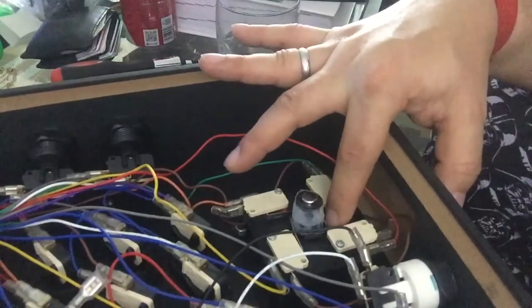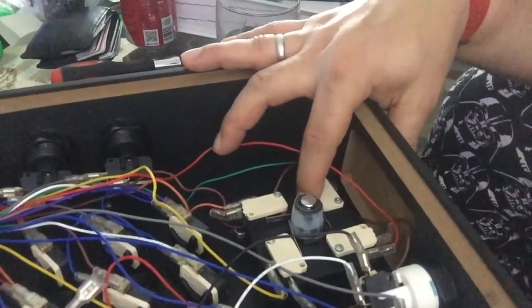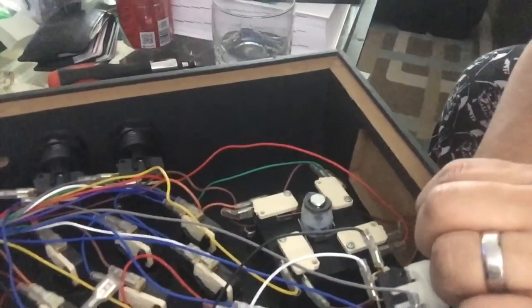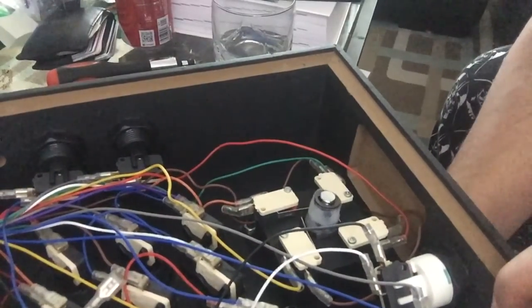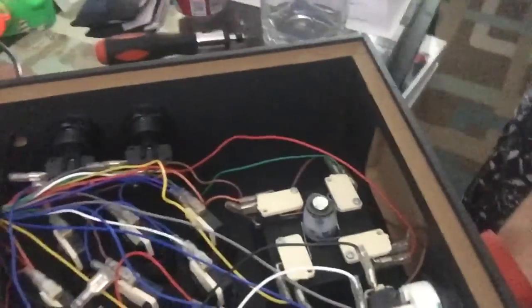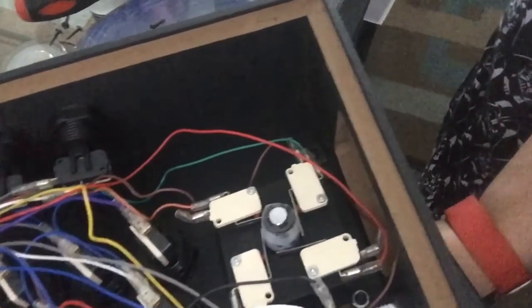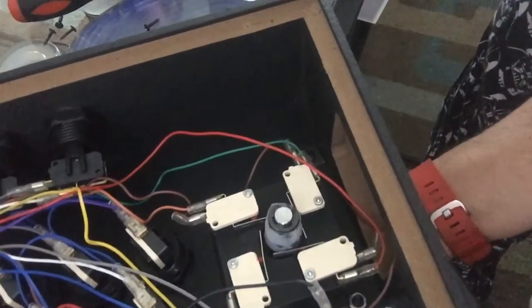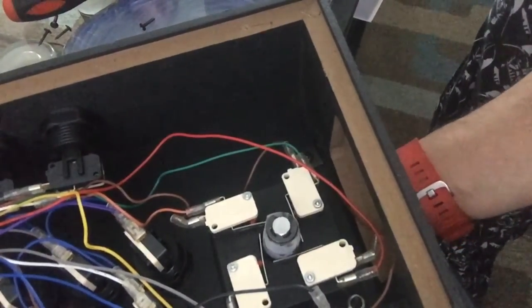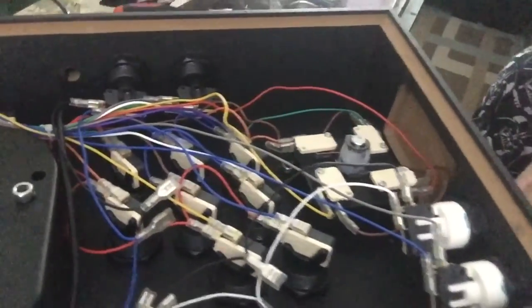As you can see, these switches have these arms, and these arms are not easy to get to activate. I had bent them as well to try and give a little bit more play. I'm trying to do a diagonal and as you can see it's not really firing both of them — you have to kind of jiggle it and move it back and forth in order for both switches to be simultaneously hit.